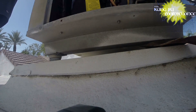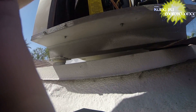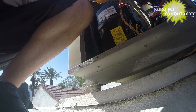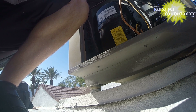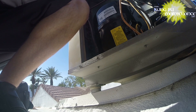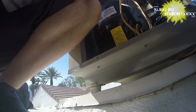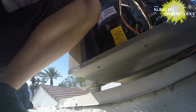This one seemed obvious — the air filter was really clogged and that was the quick fix. Changing the dirty air filter and turning the fan on will melt the ice really fast. This was a slant coil, so it'll help the moisture run down and into the pan so it drains. Sometimes you may want to put a towel down if there's a lot of ice, or vacuum out the condensate pan if it's putting out a lot of water. Come back in five minutes, vacuum it out, let it run another five minutes, and put towels down to protect carpet or drywall. Just thought those things were worth mentioning — thanks for watching.